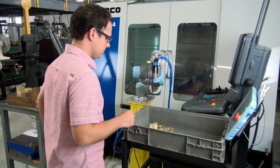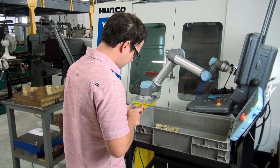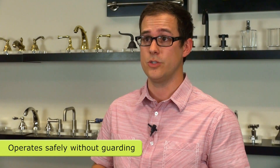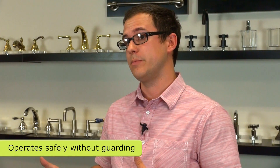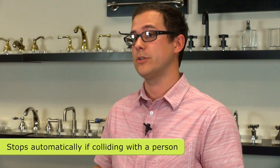The robot itself was a lot faster than I expected. Within the 45 minutes that we booted up the robot for the first time, we were testing safeties on it — using various accelerations and joint speeds, running it up against people's hands, just a firm stop, to test how much force it would actually take to fail out the robot. That was really surprising for us because the robot is very sensitive to outside force. It's one thing to say the robot can be used without guarding, but it's another to actually use it safely without guarding.